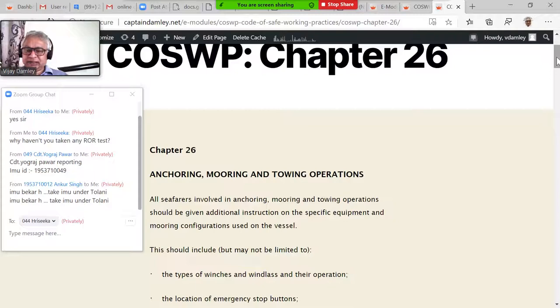It has got a moving part, even though you will never be able to move it with your hand. They weigh a lot. They weigh more than a truck. Anchors do weigh anything 15 tons, 20 tons also, depending on the size of the ship. And based on the same principle, anchor is big, anchor cable is big. Anchor cable is made up of different links like a chain. Each link is very heavy, and joining shackles, Kenter joining shackles and all, are even heavier than the ordinary links. There are studs in the link. The link is like this, and there is a stud in the middle. That stud's purpose is that it should not jumble up and get locked up. That is why there are studs inside.